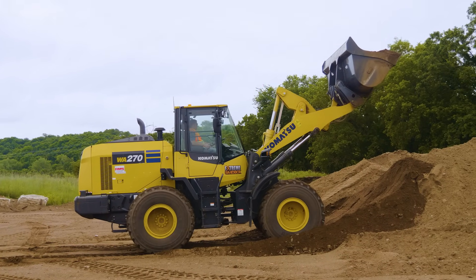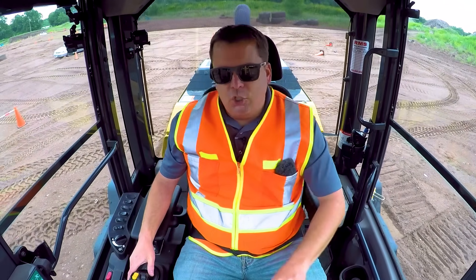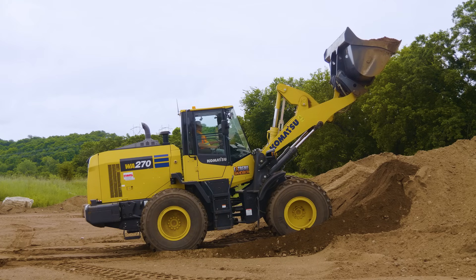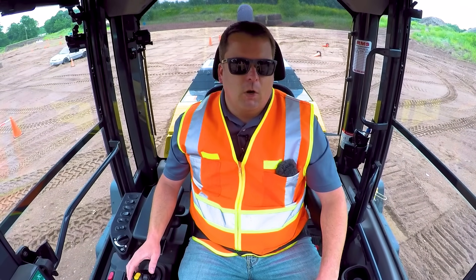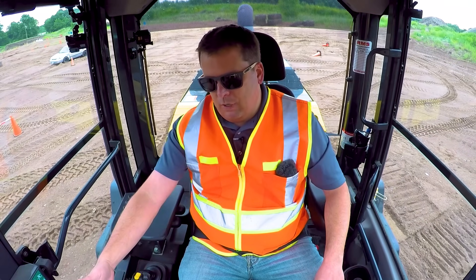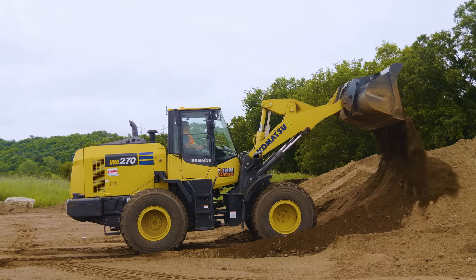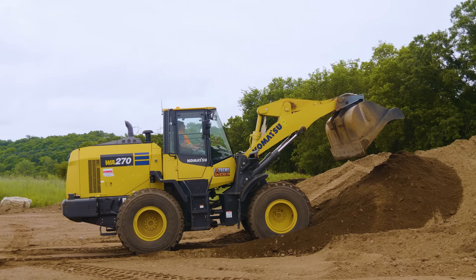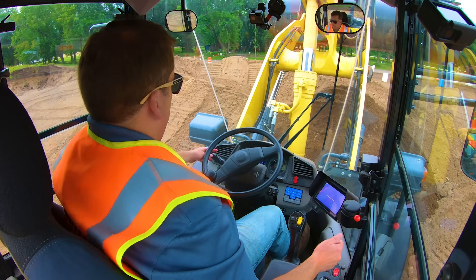Drive up to your dump spot, but don't let your tires drive up the pile. Go up just high enough to clear when the bucket opens — when you open it, it comes down about four feet. Be aware these machines sway when elevated, and that's where it can get hairy. Don't do any aggressive maneuvering or hard reverse when you're up high — that's how you end up flipping a wheel loader. Keep the base relatively level, go slow, and slowly open the bucket to dump. If material sticks, you can bang it a little. Then use the auto-curl to return to scoop and click reverse.